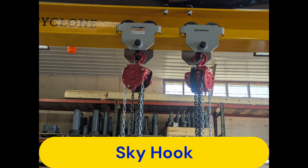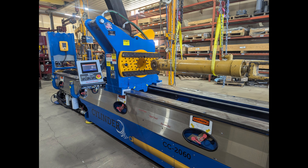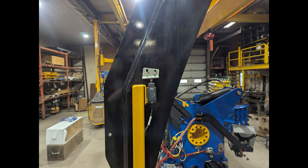The Skyhook is an overhead crane rail with rolling chain hoists, featuring a 3-ton combined lifting capacity. The Skyhook is center-lined with the ACRA torque head, making alignment a simple task. It's fitted with an overload stop switch to maintain safe operations.